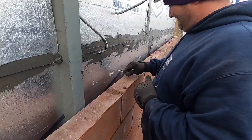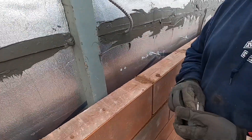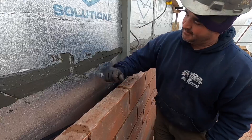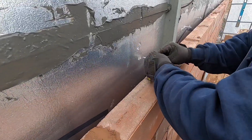Every three courses you gotta put some wall ties in. We got metal studs so we got self-tappers with some washers. All you do is stab them in the wall — like this. It's perfect right here, like this — stick them in there, holds the whole wall. That's all you do. You gotta find the stud — stab it till you find it.